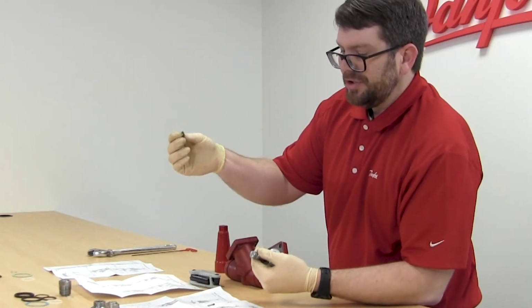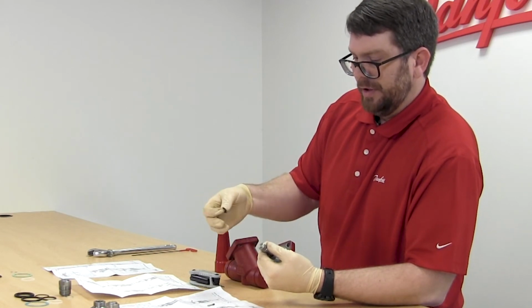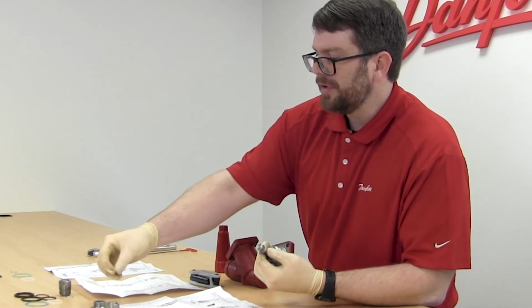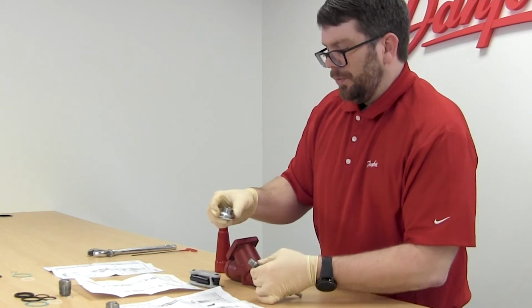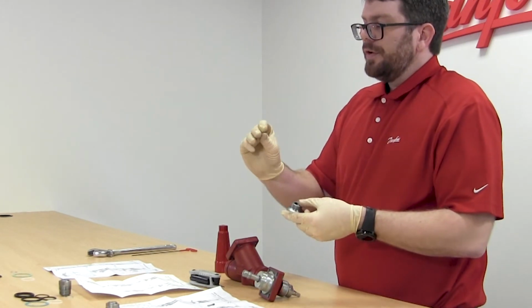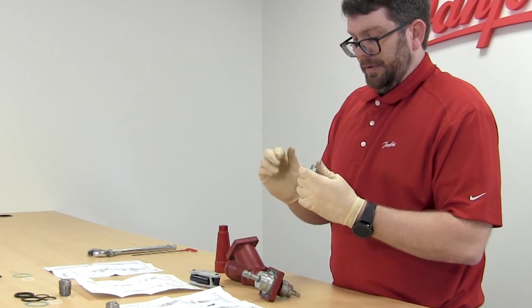There's a piece of spring steel between the cone and the spindle interface. This allows the cone and spindle to remain as one until the cone comes in contact with the body. It then allows it to turn the spindle with the cone remaining steady. You want this to go in such a way that the spring steel is concave up.